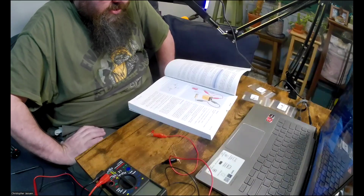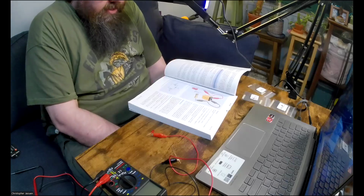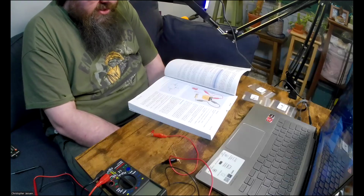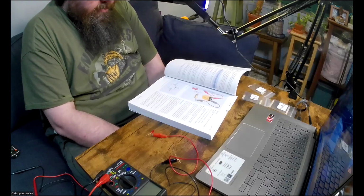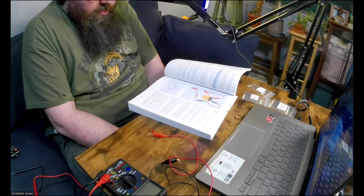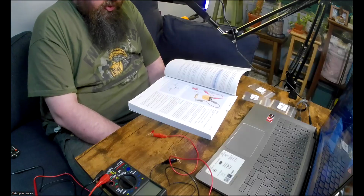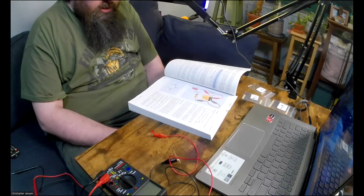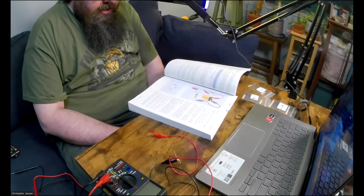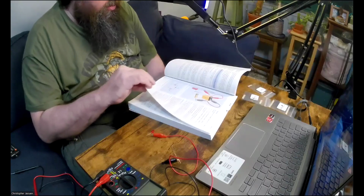Notice the two instances of polarity in Figure 2.8. The long line of the battery symbol indicates the positive side of the battery, and the big triangle inside the LED symbol always points from positive to negative. The small arrows are just there to remind you that this is a light emitting diode. Other types of diodes exist which don't emit light. In Europe, the symbol for the resistor is just a rectangle with its value printed in it. I'm using the zigzag American symbol here, and some people in Europe still use it too.